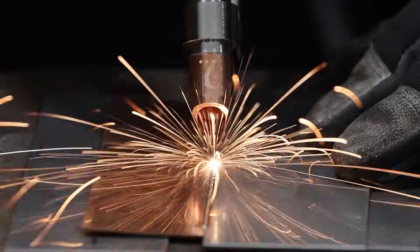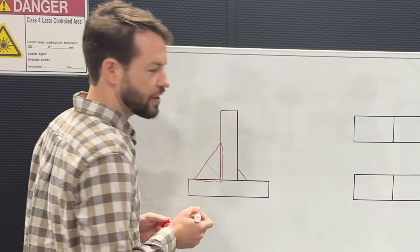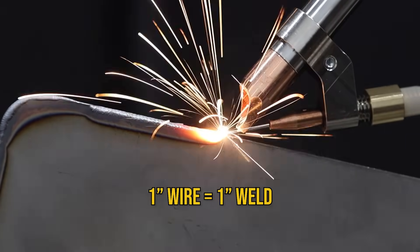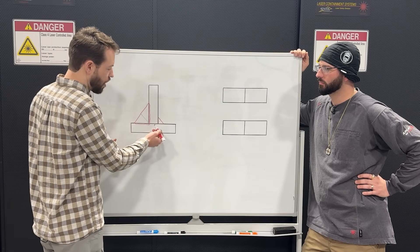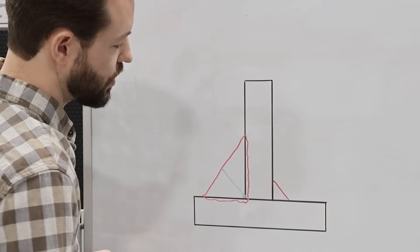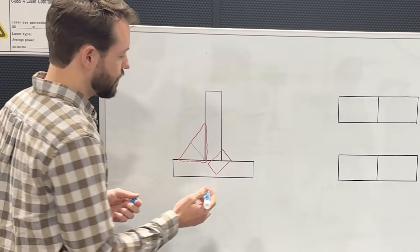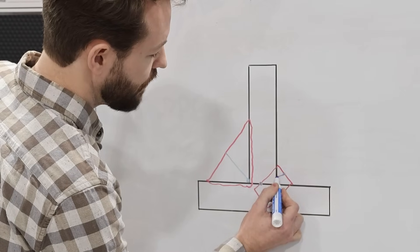When we're laser welding, a lot of our strength comes from depth of penetration. What I see a lot of times is very small fillets when dealing with a handheld laser — yes, it looks much smaller than a MIG weld. When laser welding, the wire is pushing the torch along the joint so one inch of wire equals one inch of weld. That means whatever filler wire diameter we're using directly controls the volume and size of our weld. We may have a much smaller weld but we can penetrate much deeper, and typically instead of a triangular cross-section with a MIG fillet, we'll have a rectangular cross-section of that joint. Our effective throat with a handheld laser welded joint is the minimum distance from the intersection of our fusion zone to the shortest distance on the face of the weld.